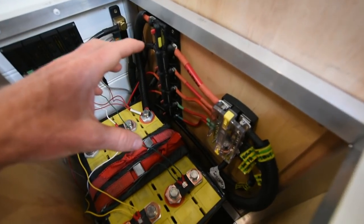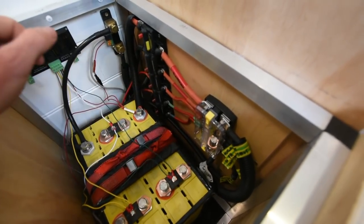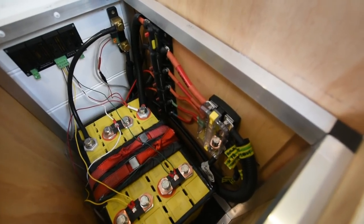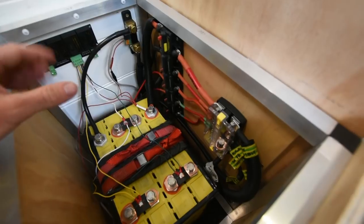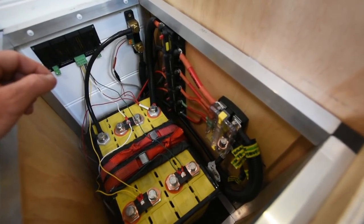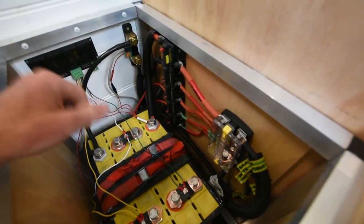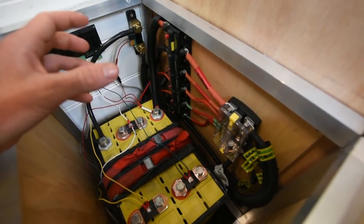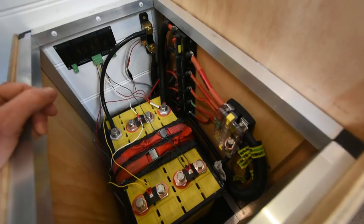Another key element when doing your own electrical systems is to be really careful with your cable thickness. Make sure your cables are the correct thickness based on the current and the distance of the cable — you can work those out using easy online calculators, which I'll put in the description. Same deal with the fuses: make sure all your fuses and circuit breakers are correctly sized based on the load. There are calculators that do all that for you — it's nothing really complicated.